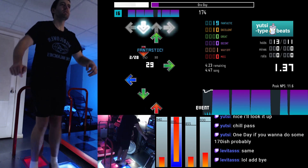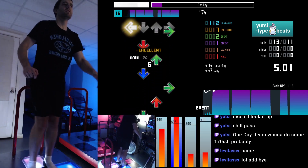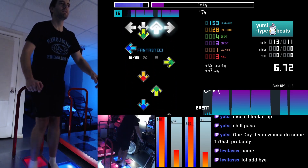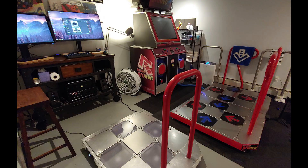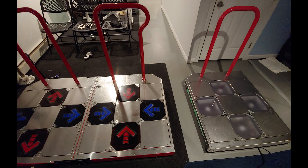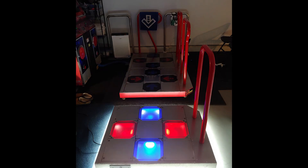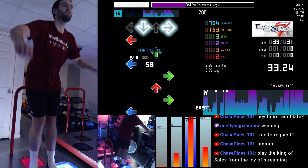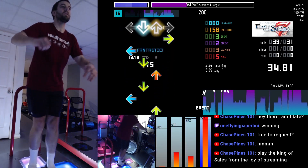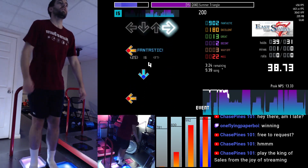And that's it — I have an FSR pad now. I'm still working out some bugs and trying to get it as close to the feel of my Dedicab. I'm having an issue where it's a bit too sensitive and I'm running out of headroom on the UI to change the threshold. To remedy this, I'm planning on swapping out the 330 ohm resistors with a different value, which should change the sensitivity. I put my 32 inch LG 144Hz monitor on a tall bar height table, slapped a PC underneath it with some speakers, and now I have a pretty cool little SM5 cabinet slash streaming station. I love my Dedicab — playing on it is a lot of fun and it's a unique experience. But it's so nice to finally have a setup I can just turn on and within a few seconds have ITG running at a crisp, clean 2K resolution. Nothing in this closed loop system is troublesome to fix, unlike the Dedicab where a hundred things could break that are literally irreplaceable. Anyways, thanks for watching everybody — hopefully this video will help out a person or two who is thinking about making an FSR pad out of a DDR pad. See ya!